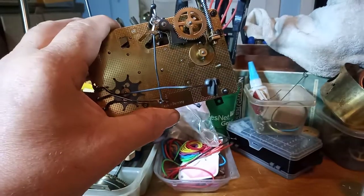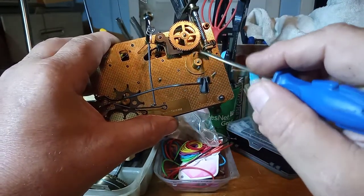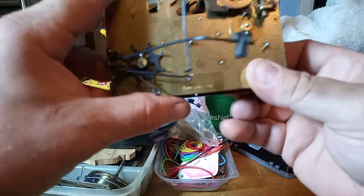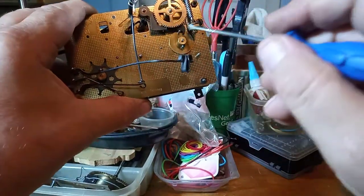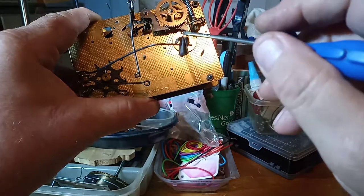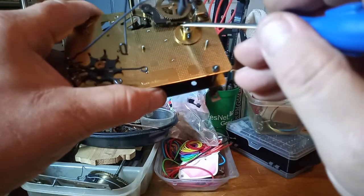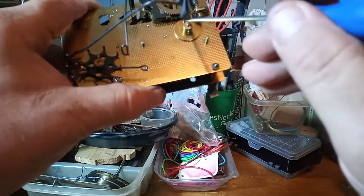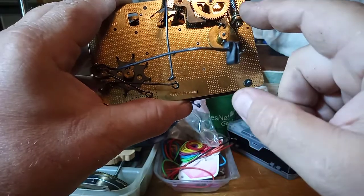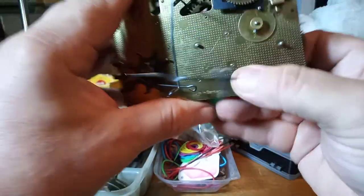And then the pin is going to catch this black tab right here. And when it's done cuckooing, like I said, this black lever acts like the wire in a regular music box, and this pin is like the governor fan in a regular music box. And so when it's done cuckooing, that's when the governor fan actually turns and the music plays.